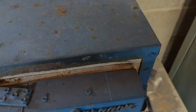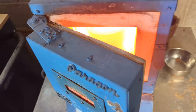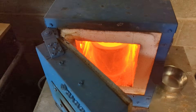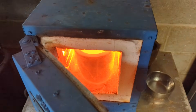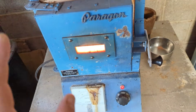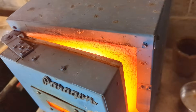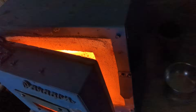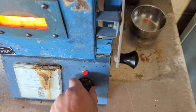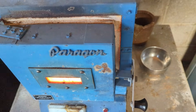Now we wait. After about an hour and a half, I'd guess it's probably sitting at around the 2200 to 2300 degree range. It has been three hours since we put these rubies into the kiln and it is looking quite toasty in there. We're going to turn this off and let it sit and cool down nice and slow so they don't crack or anything further.